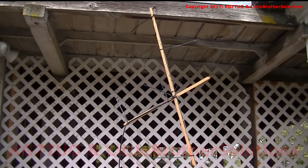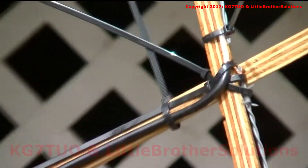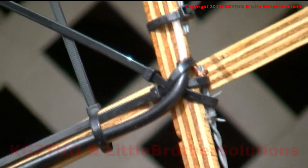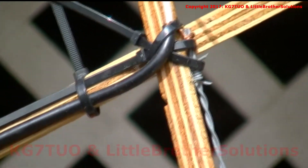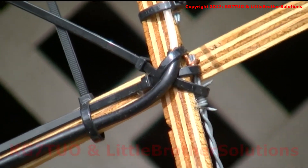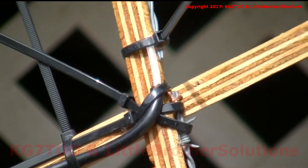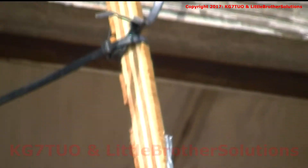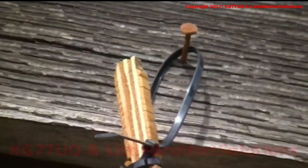The feed line — if you can notice — is not soldered. The feed line is zip tied onto that little cross; there are two zip ties making the cross. The feed line is under it and just twisted around the barbed wire. The barbed wire goes up, zip tied on it — I didn't even take the time to cut it off — and then a zip tie at the top to hang it from. That's not where I transmitted from, and I used this for two weeks.